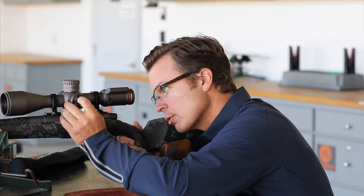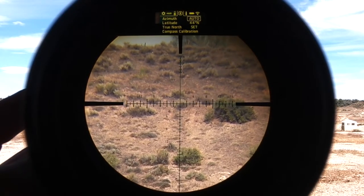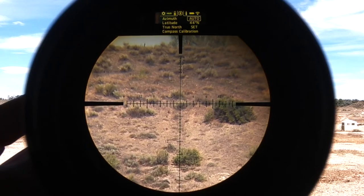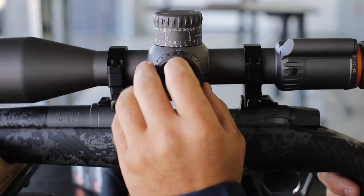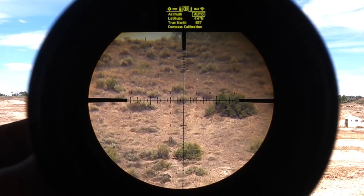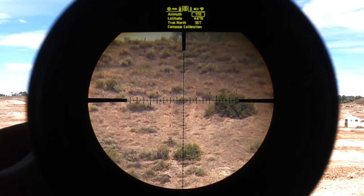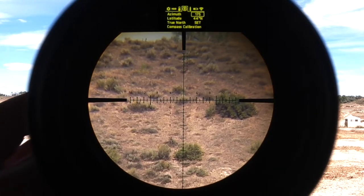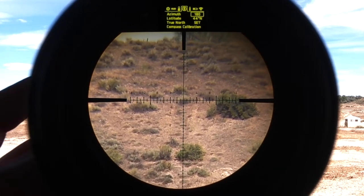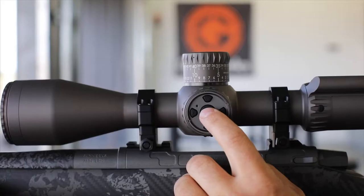On the azimuth, we're going to do it just like we do the temperature override. I hit enter once, so now the highlight is around just the auto or the portion that I want to adjust. Then I'm going to go up and down — this is in degrees, so you're going to have to do your directions by degrees. I'm going to go 180 degrees, which would indicate south. And then hit enter to save it.